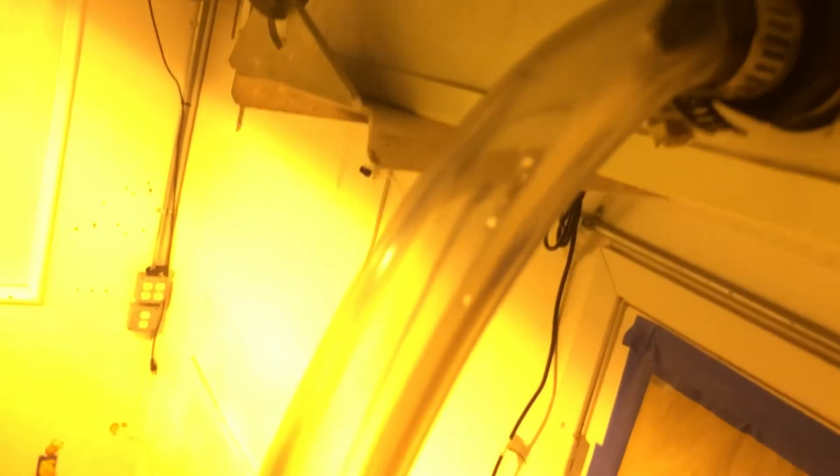Let me remove the power here — there we go. Now let's pull this drain line out. It's not coming out easily and there's slime in there — gooey stuff too. There's clear slime building up on this tube. This unit needs a proper condensate drain and needs to be repositioned so it's not being fed cool dry air or hot dry air.